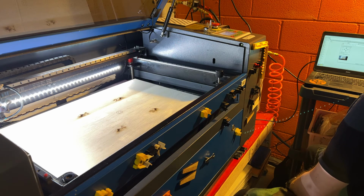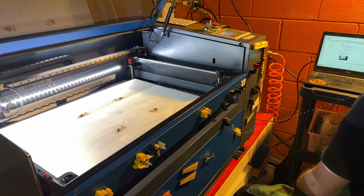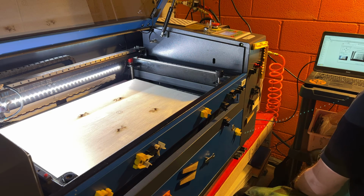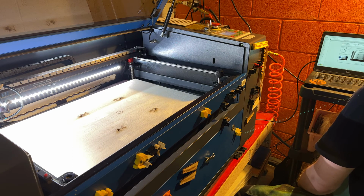So now what it's asking is it's saying use the buttons to jog your laser head to clear it from the camera below. Laser head's in the back left. We don't need to do anything there. Now we're going to capture the image. So from that image capture, we are going to zoom in on the various sections. So it says press capture image. When the captured image shows on all corners clearly, click next to continue.